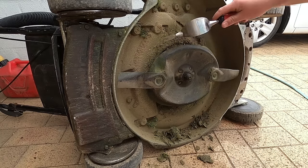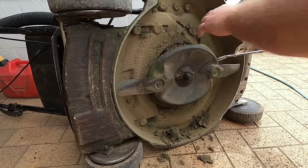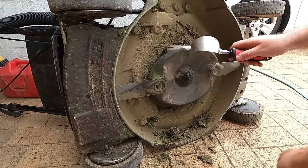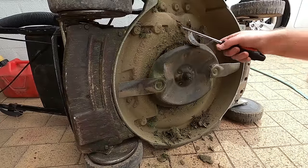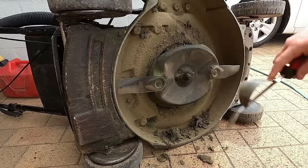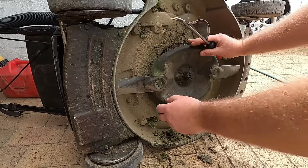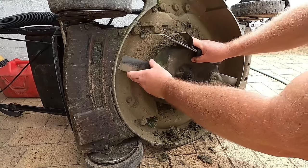Now, the beauty of having these swing blades is that it's not really necessary to balance them. That's what the cutting disc does. And for anyone who hasn't seen swing blades, this is the reason why I'm happy to take my machines through such gnarly shrubs, and I don't care if we hit sticks and that, because what happens, they literally go that way, they swing.